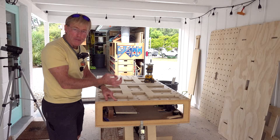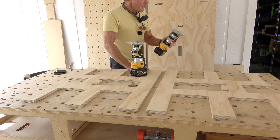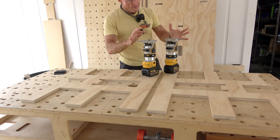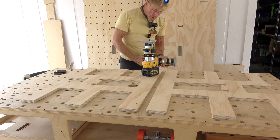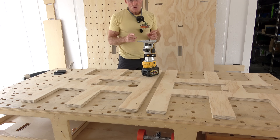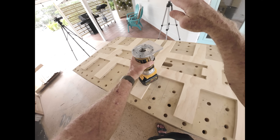The longer or deeper the 45, the further the bench dog will drop down. Typically when I'm working with plywood I do a round over, and I could run it either way, but what you can do is just set up and chamfer everything. So in this situation I'm going to stick with one router, one router bit, and chamfer everything.